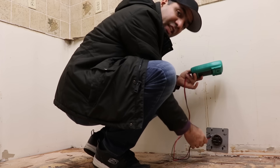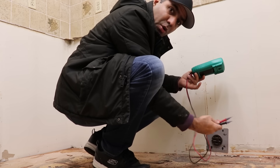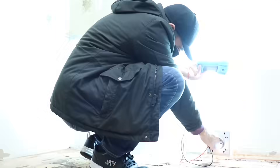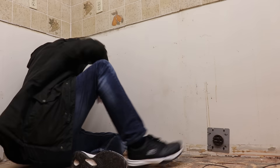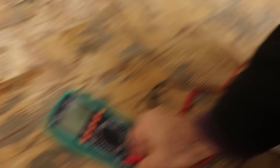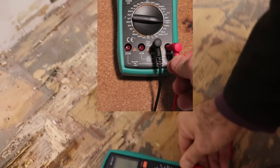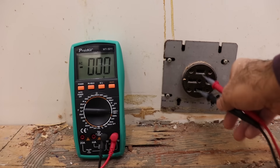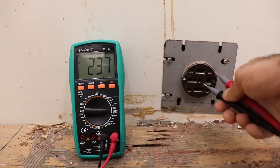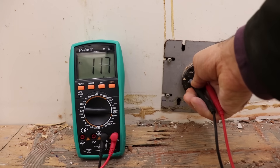I'm in a house that's being renovated — let's check the voltage here. This is the oven outlet; the voltage reading will show us if the phases are 120 degrees out or 180 degrees out. The meter was on current — always make sure it is on voltage before you measure voltage. There we go: we have 240 volt AC, which means our 120 volt AC lines are 180 degrees out of phase. So it is true — they wire houses differently than apartments.